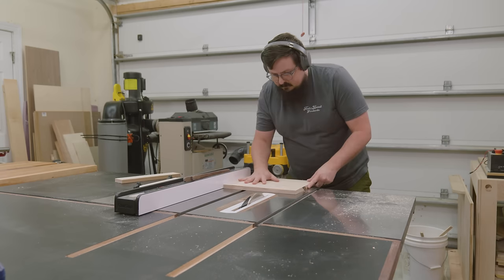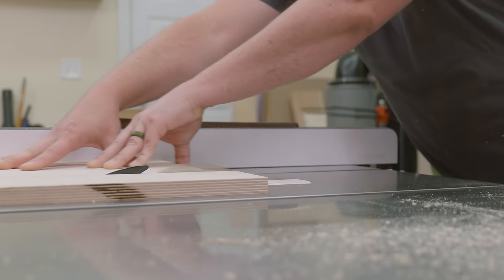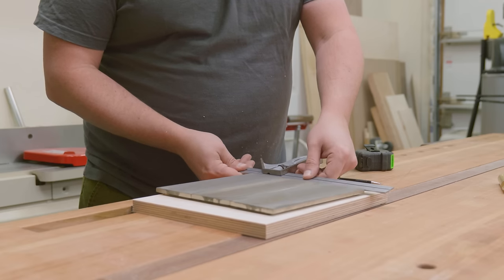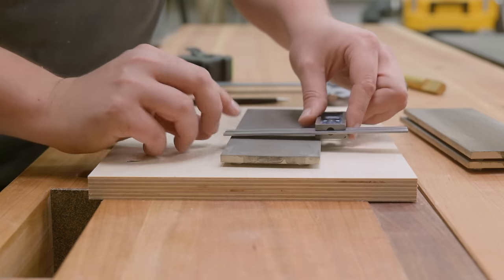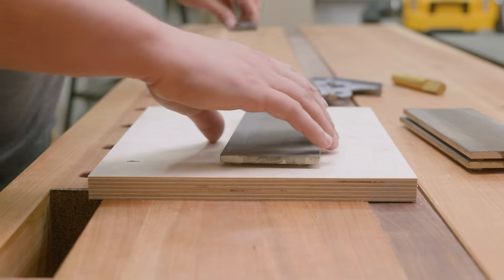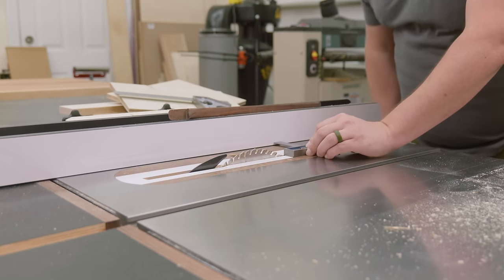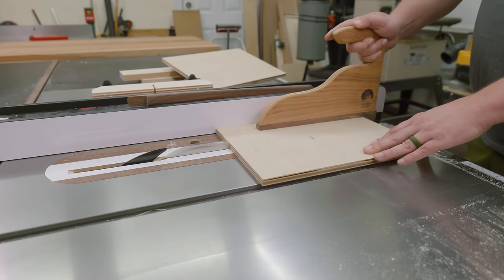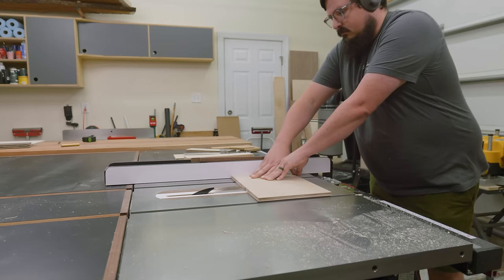What you see me doing here is trimming out a panel of Baltic birch plywood. I've already got all the dimensions in a plan based off Paul Sellers' design, so all I did was trim that out. But one thing to consider with diamond plates is that each one will be uniquely sized — it's not a good idea to just go off a plan, you really need to measure off your actual plates. While all the plates are the same 3-inch width, they are different heights. Even though these are supposed to be 8 inches, one of them is like 7 and 15/16ths, while another is like 8 and 1/16th.